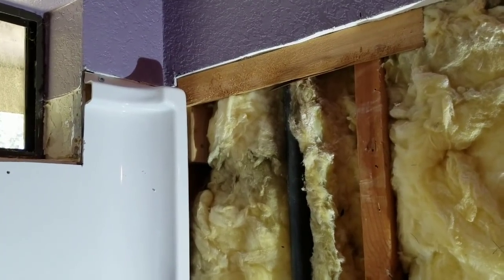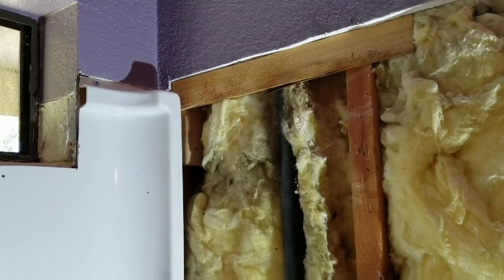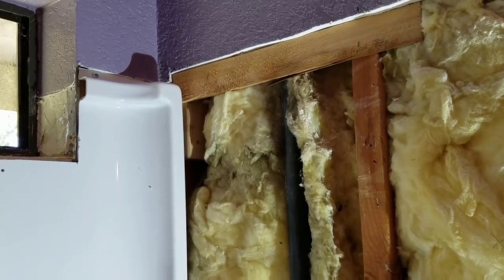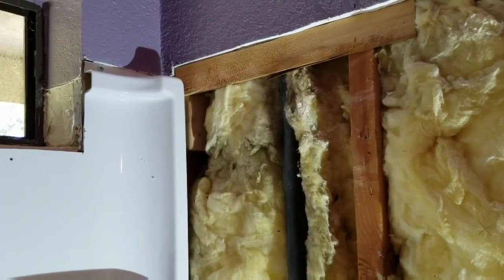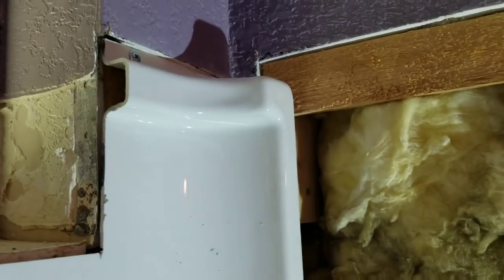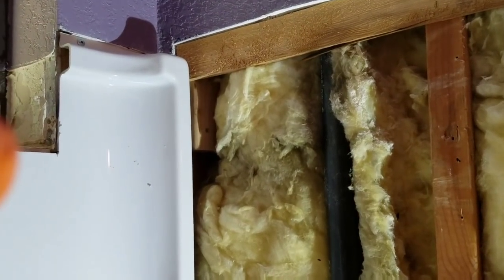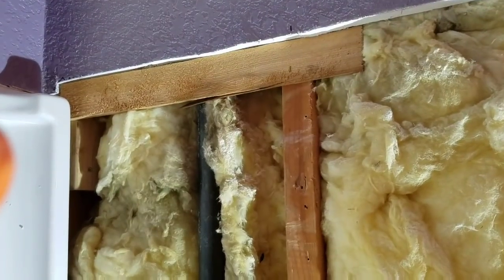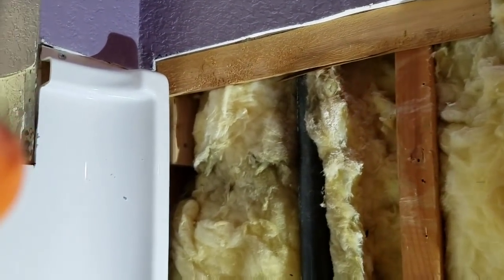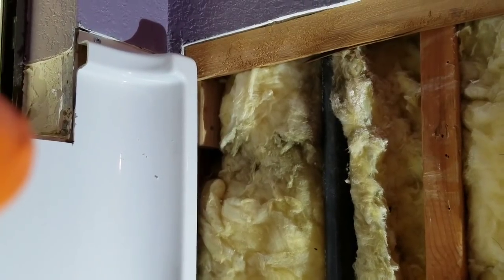When the walls are on, they may not be perfectly level and square, so you've got to do what you've got to do. I put a block behind there in the far back, then I put a piece of shim across the top — that gives me the right connection when you put them together, and it's all nice and solid. When you're doing framing, you just look at it, see what it needs, and handle it. Here I had to bring it out about three-eighths of an inch — there's a shim in there. It goes from three-eighths of an inch to zero, which works out perfect because this side was already perfect. Just make everything right, make all the corners square, and it'll turn out perfect.